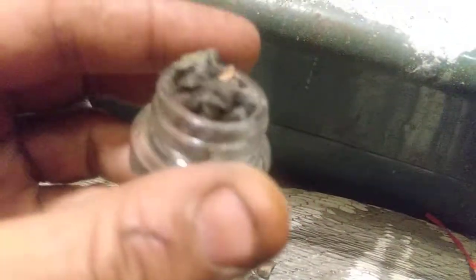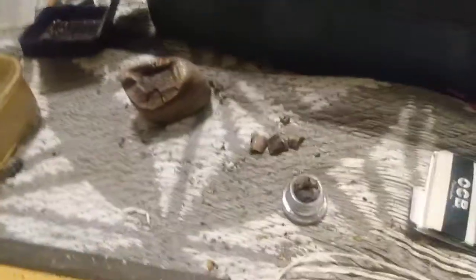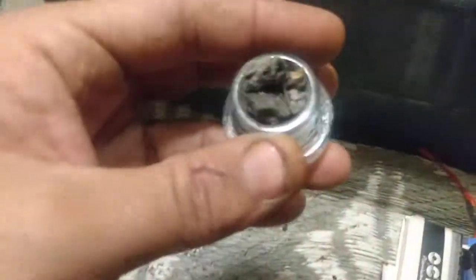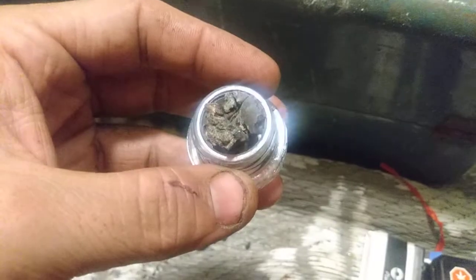I have that: a whole bunch of slag with a whole bunch of my gold powder in it. And I still have that, which is gold powder mixed 50-50 with borax, so that I can just keep pouring it out, and I'll add some more borax on top, pour it out, and mix it like that, and that is actually working. And just to test it, I did it, and it created a small ingot, which is essentially a precious metal button. And at this point, you really need to do a lot of research on refining to know what I'm talking about. But we're about to get technical.